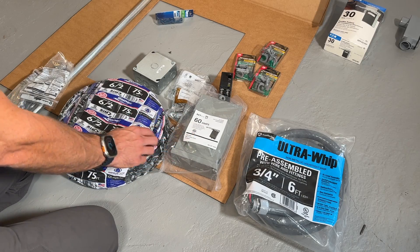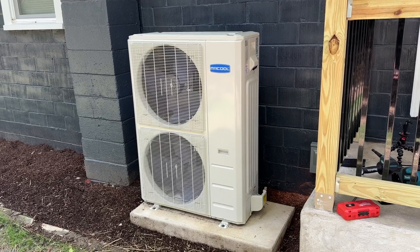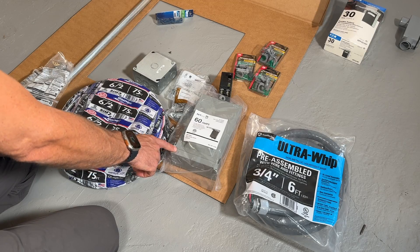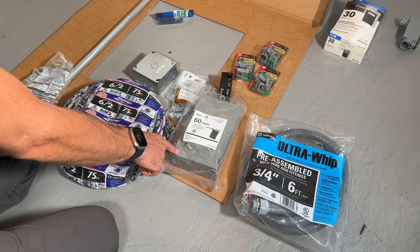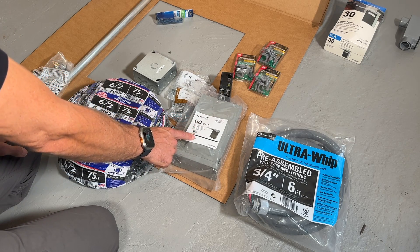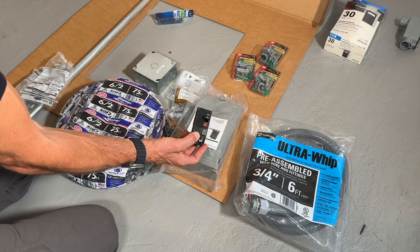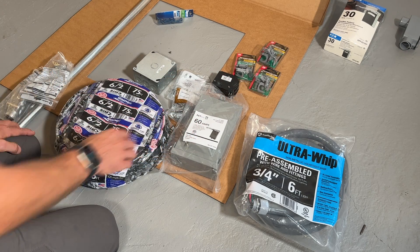I have a bit of a hybrid. You're going to see it's a 36,000 BTU electric heat pump that actually feeds a Mr. Cool hyperheat universal setup that plugs into my existing ductwork. It's a really cool unit — a swap for an old oil burning furnace. So I need to provide a 240-volt 50-amp circuit out to the heat pump, and I can use the 60-amp disconnect because remember, this is not your circuit breaker. I'll have my Square D QO 50-amp circuit breaker feeding that circuit, and I just need a disconnect that is 50 amps or greater, so the 60-amp will do.